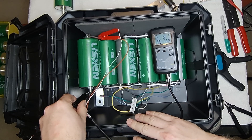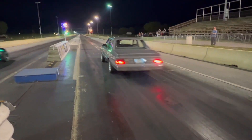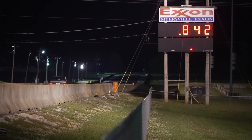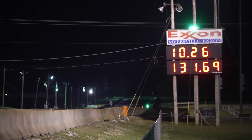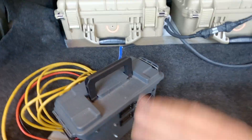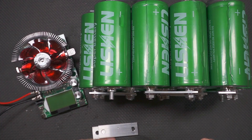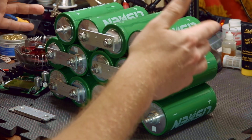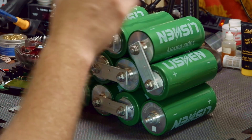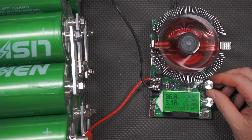Something like this must have downsides, and sure it does. These are great for testing but not so great in application — although we have used them in the car at the track for safety and power output reasons. They're big and heavy, with a relatively low power density. Regular lithium polymer batteries can have up to 4 times higher power density, meaning a pack can be 4 times lighter and a lot smaller with the same power output. They're also unfortunately expensive. I think I may have found a manufacturer of a more commonly available lithium technology battery pack that's smaller and can still provide the power output we need — I'm very excited to do that testing and I've already got one sitting on my other workbench.